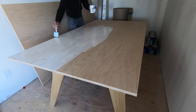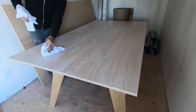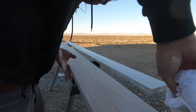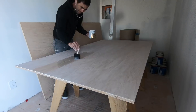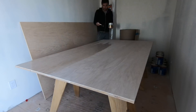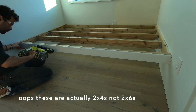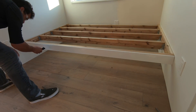I wanted to take down the color of the oak a little bit, so I used a Varathane wood stain in antique white. For the front edges of the bed decks I'm going to use a piece of 3/4-inch solid oak, and I also hit this with the Varathane antique white. Now the stain gives us the right look, but to protect the wood I'm going to coat them with two coats of Varathane polyurethane. While the polyurethane is curing, I cut some 5.5-inch wide trim boards to cover the front faces of the 2x6s and used my nail gun with finished nails to fasten these in place.